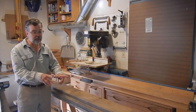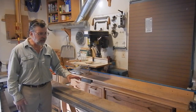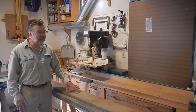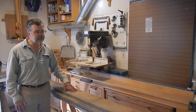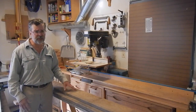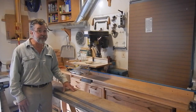The widest boards, the longest boards that we'll need, will be 43 inches for the forward section of the floor, and back where it splits around the centerboard trunk, there are about 20-inch pieces. So what I think we'll do is divide these roughly into thirds and trim off some of the waste at the ends, and try to come up with something about 44 inches just to give us a little flexibility.